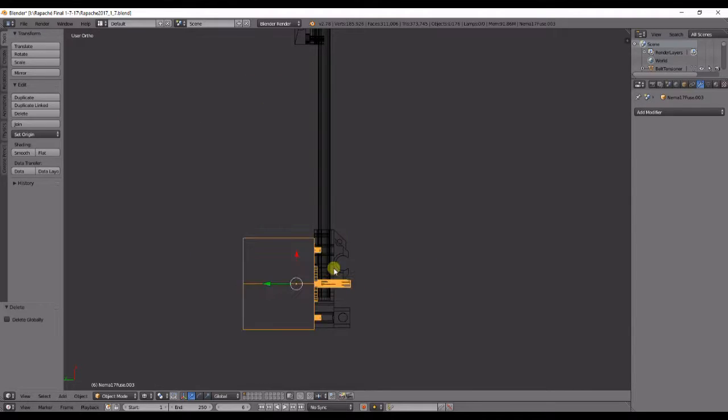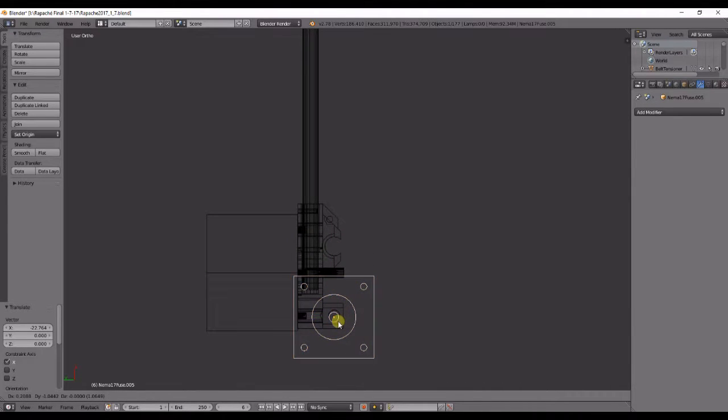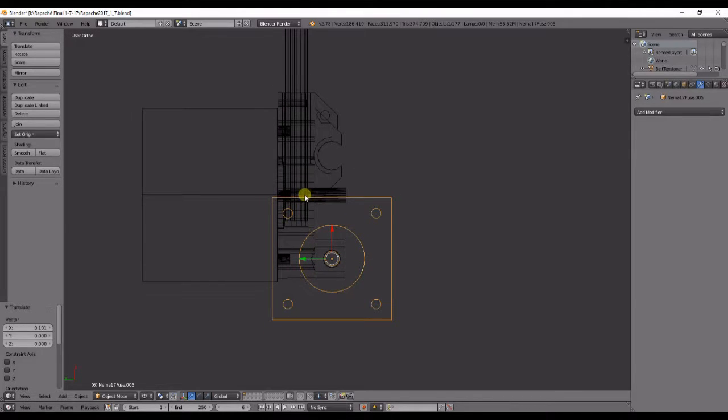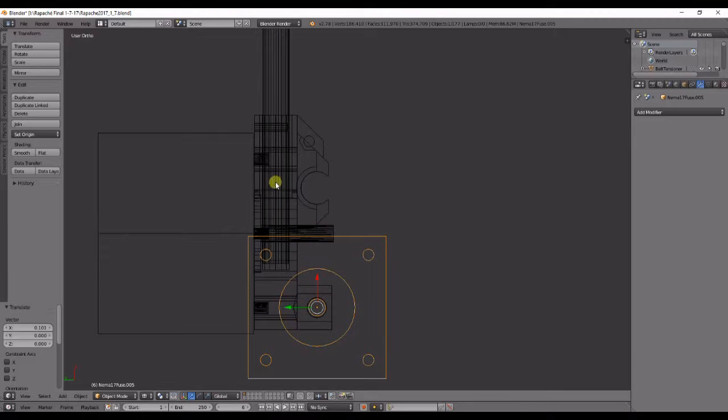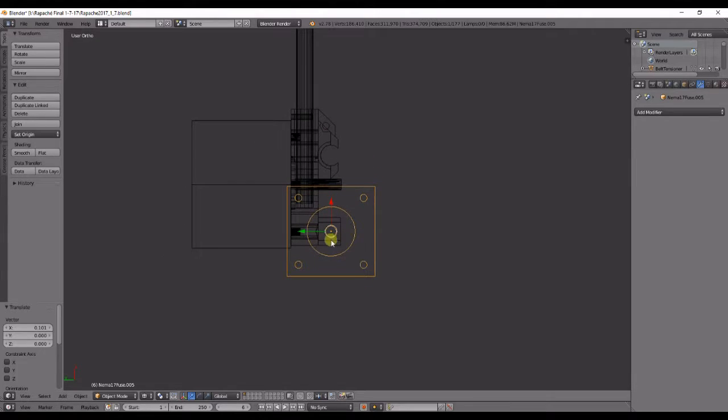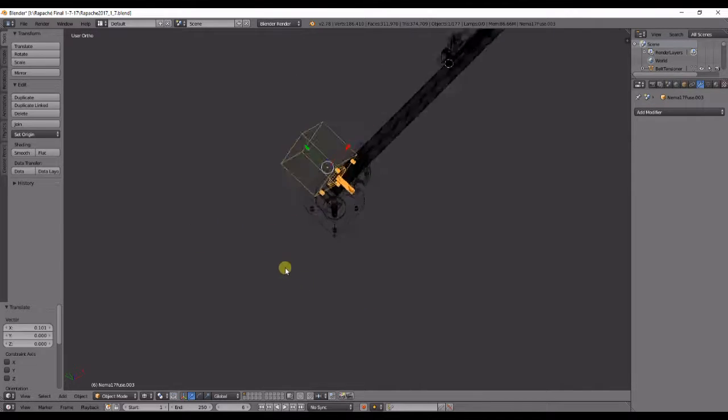Now, so far, this section right here is what is setting the depth of the briefcase 3D printer. This is the furthest point for it, because the motor for the Z-axis is this wide, and centering it over the lead screw hole. Now, alright, so far the width of this is up here, and then the box is around this Z motor, stepper motor. So far the box for this 3D printer goes from this side of this motor to the back side of this motor.